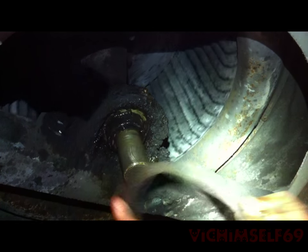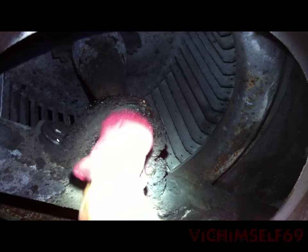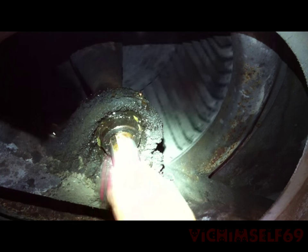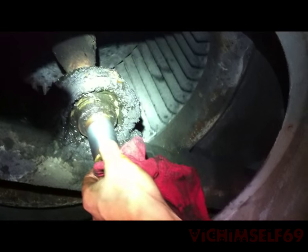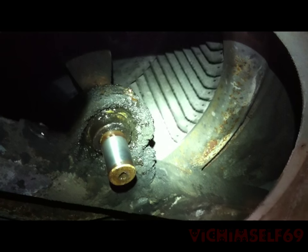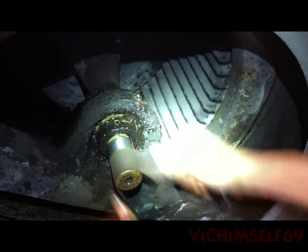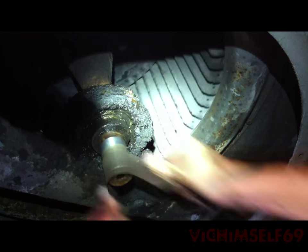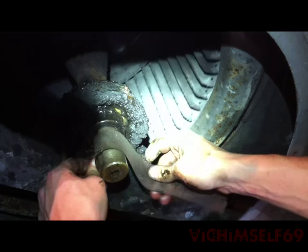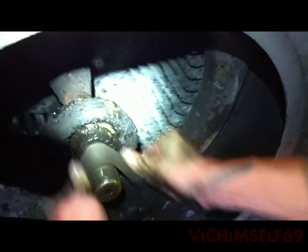Alright, we're back at it. What we're doing now is sanding down the shaft. All these rust spots you see there — they're going to be completely clean. Apologize for the camera as well. It's important to clean that shaft to make sure you have a nice even surface and you don't have any gouges, otherwise it's going to be really hard to pull off the bearing.